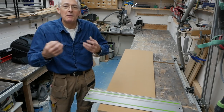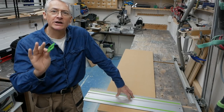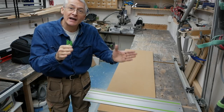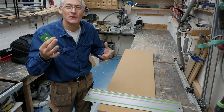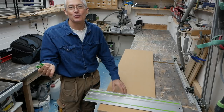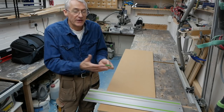Then I can make my cut. There's no measuring into a pencil line or anything like that. These packers are two millimeters and the blade kerf is 2.2 millimeters — that extra 0.2 of a millimeter is spread either side of the cut line, so we're actually working to a tenth of a millimeter. If that's not accurate enough for you, you're probably watching the wrong channel. I've done this for years and years and haven't had any problem. It's a really quick, simple, easy way to set your guide rail to a cut line without using a pencil line, without measuring or marking. A two mil plastic packer and a combination square gets you repetitive accurate cuts on narrow rips when you're cutting the wrong side of the cut line with a plunge saw.